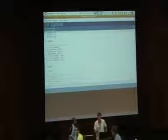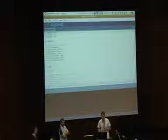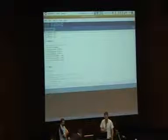Great, thank you. Now this little program is very handy. It's basically something that I use a lot, or I use something based on this a lot when I am trying to put some kind of a software interface onto an appliance that doesn't already have it. Basically anything with buttons, you wire across it with one of these, you run the software on the Arduino, and you can then talk through the serial port and control the outputs. And essentially you can soft press the buttons.